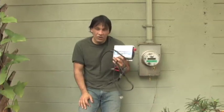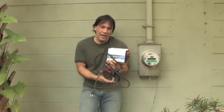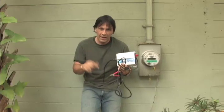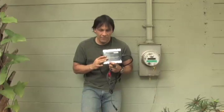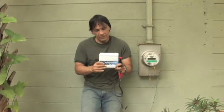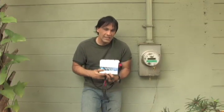That doesn't really matter for your house because you're going to be pulling a lot more than what this inverter does, so it will supplement the grid inside your house. Anytime you hook a new electrical device up to your house it's a good idea to be around for a couple of days while it's on, just to make sure everything is okay. If you're not experienced with electricity, get someone who is to help you. This is basically a plug-and-play model — not much simpler than this — but make sure your panels are hooked correctly. You can hook your panels to batteries to this, just keep the voltage between 14 and 28 volts. If you see one green light or the fault light, it's not working; if you see the green lights clicking along, it is working. This 200-watt unit was about $350 — they should come down in price just like inverters did. I'm your host Dan Rojas. Thank you for watching and enjoy our videos.